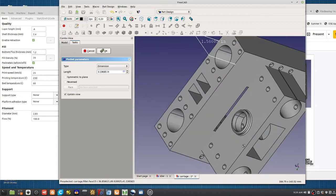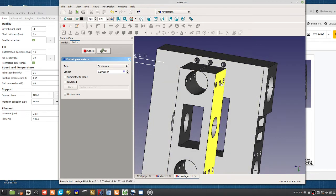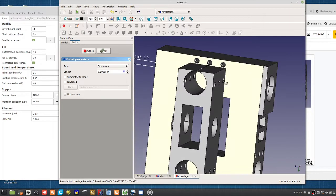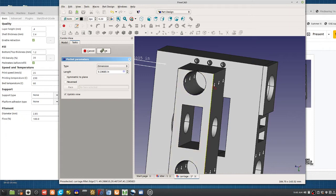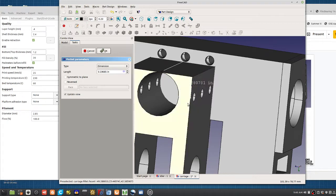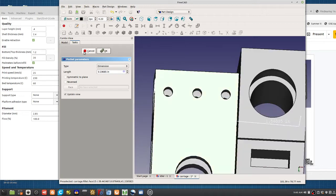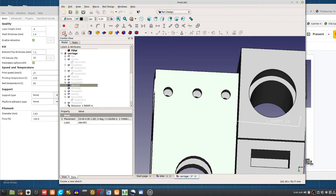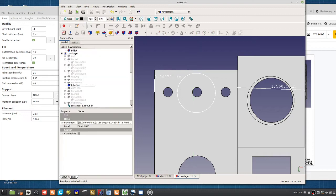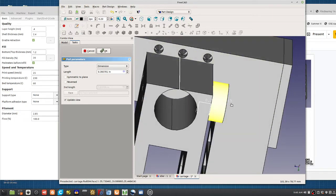What I would modify here is on an idler, you want to grab the rod by clamping it down. So you can put in a bolt through one of these holes through the side, and you've got about 1/4 inch, about 6 or 7 millimeters, where you can grab a bolt onto that. But what I would do is make that a more solid connection. So I would build up this side here, give it a little pad, and then poke through it. So you've got much more meat if you want to stick a bolt through this.